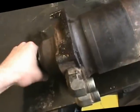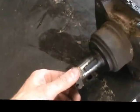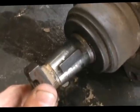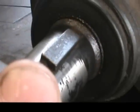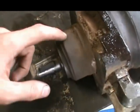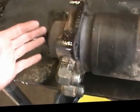These things are kind of scary to some people, but I'll show you how they go together — nothing real complex inside. Basically what's wrong with this one is the front bearing is worn out, letting fluid past the seal, so hydraulic fluid is coming through and getting on the tracks. As you can see, I'm wiggling this shaft up and down — you shouldn't be able to move it at all. When you get movement there, it's going to blow the pressurized ring inside this unit. This side isn't leaking, but unfortunately I have to take it all apart just to get to the bearing inside.